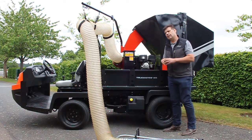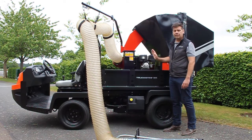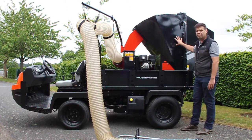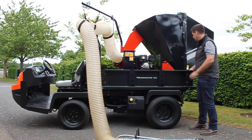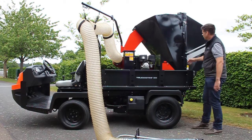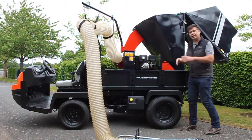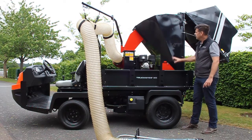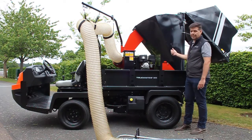Because it's a self-contained unit we don't need any power from the vehicle that it's mounted on, so we don't need a tipping bucket or anything like that. The container is made up of a clamshell — it opens at this point here and we have two latches either side and gas struts for opening. As we open up the back the material just falls out, with a nice steep angle so the material just slides out. It also makes it nice and easy for cleaning and washing down.